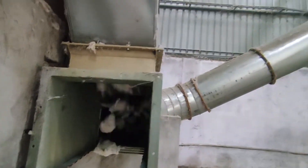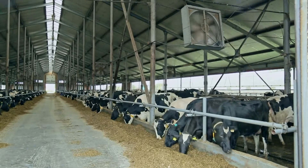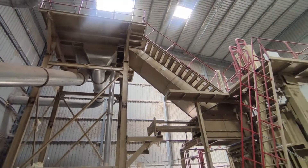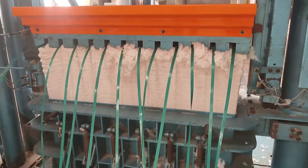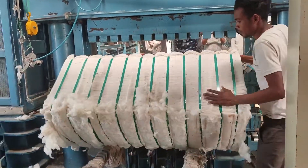The lint goes into a flue which leads to the packing area. Cotton seed is sold as livestock feed, and cotton seed is also milled into cotton seed oil. The cotton lint is now ready to be formed into bales. Pipes feed the loose lint to the press area. When it arrives, a pusher moves the lint into a machine called a tamper, which shoves it down into a bale-shaped box. Once the box reaches 227 kilograms of cotton lint, a press compacts the lint and tie wires bind the bale.